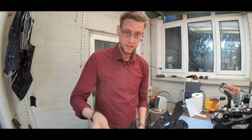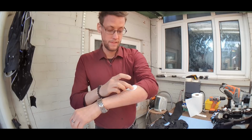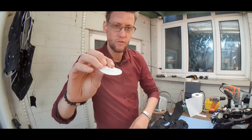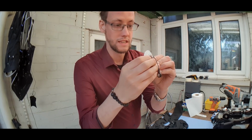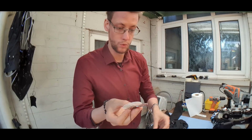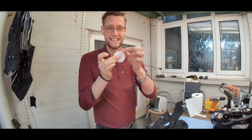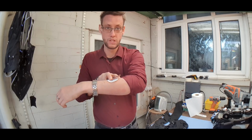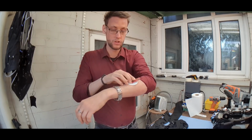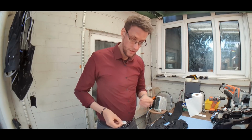Now these are pads that go onto the surface of the skin, like so. They're adhesive, and they've got really small poppers, effectively buttons on the back side, which locate quite nicely into these. On this you've got three different ports, effectively three different buttons. So they clip in one here, and then the black. These two are the active sensors. These would go laterally along the muscle from a lower point and an upper point on the muscle, and would detect the charge going across. And then the black is used as your base, so that you have a difference to measure off of. That's one permutation.